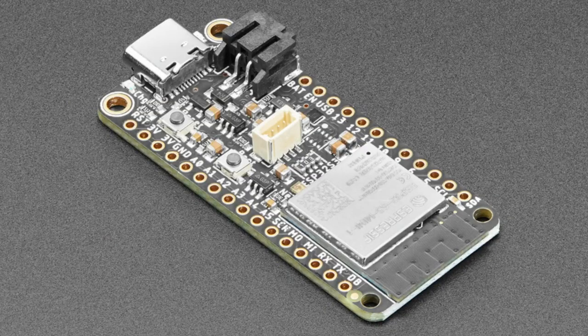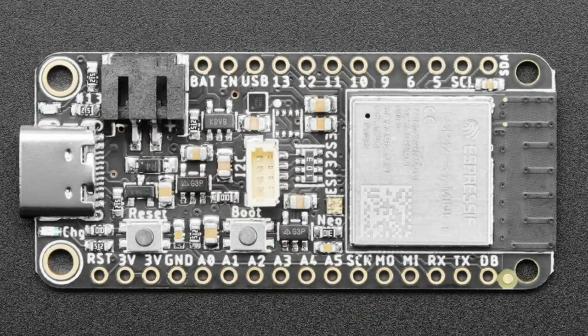You want to do emulation, you want to do I2S audio buffering, again, camera stuff, you want to do double buffered graphics using the S3 TFT driver, the PSRAM version is where it's at. If you don't care too much about whether you have PSRAM or not, then the 8 megabyte flash could give you more storage space, more flash space. So we have both available for the Feather.